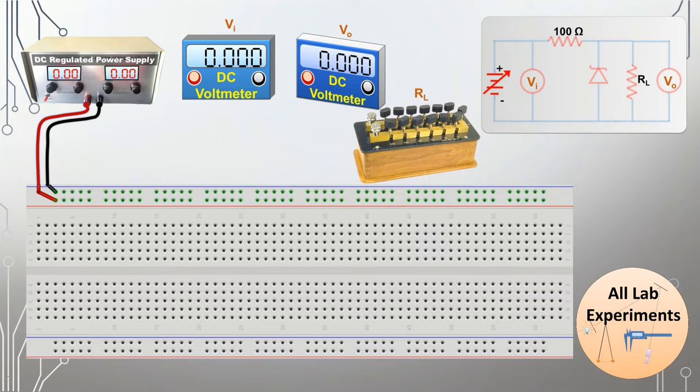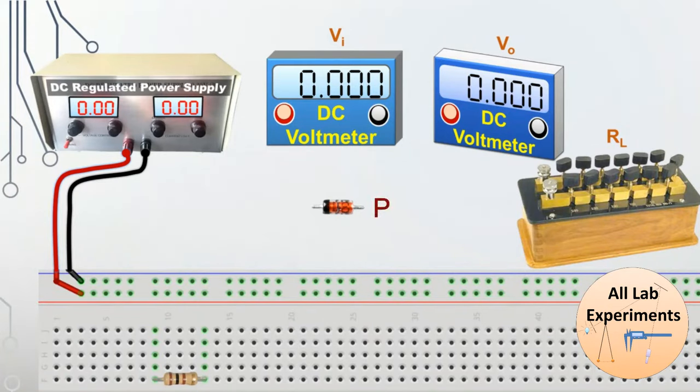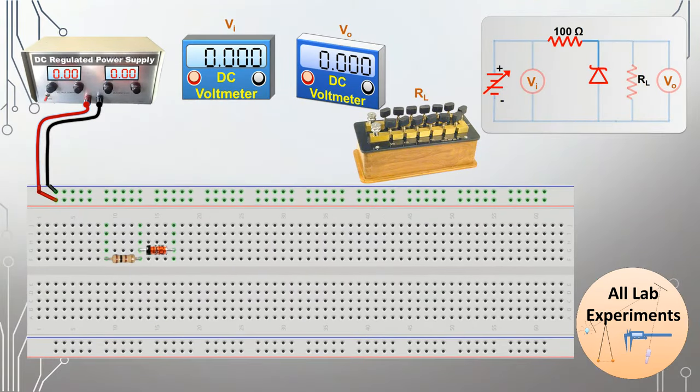In this process you will also see that as we connected our power supply with the breadboard, the symbol indicating the variable power supply has been highlighted in the circuit diagram. Now we are placing the resistance on the breadboard. Before adding the zener diode, we should know about its P and N sides. On a zener diode, the right side is P and the left side with the black mark is N. So we are placing this on the circuit board.